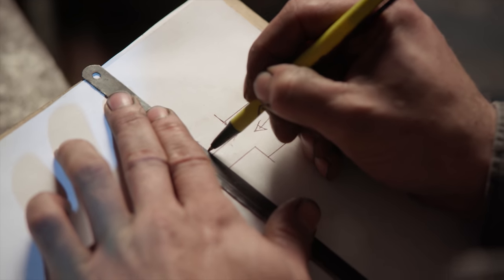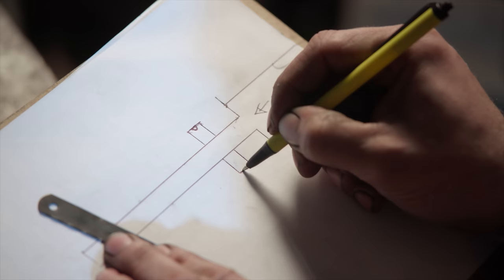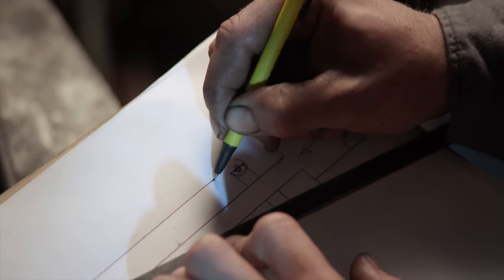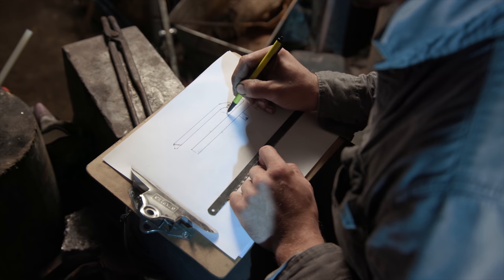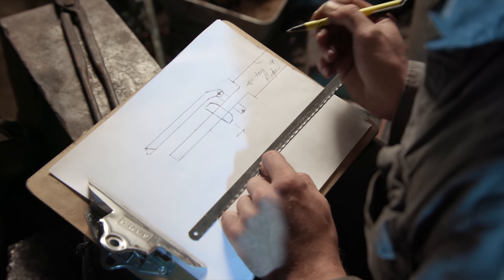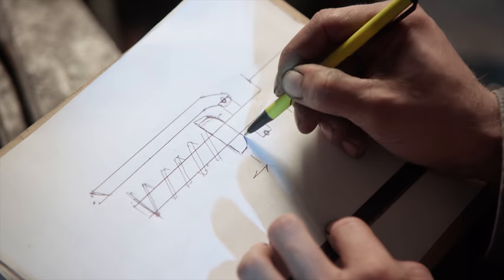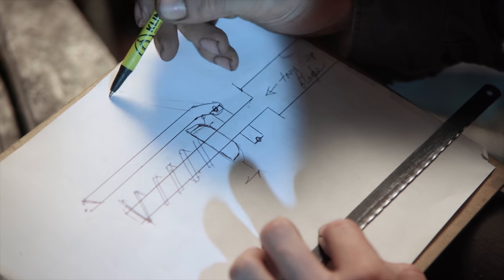So here we have the stationary bobbin, right? The bobbin has a groove lathed into it, and the blades are held by a slip spring. So the blade, there's the curve. This curve is very important. There's going to be a movable piece, and this slides in and out. And we have a push spring, which works by compression. So as this pushes in, it presses on this area right here, and this protrudes out.